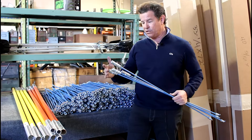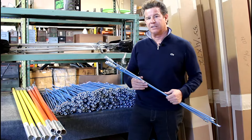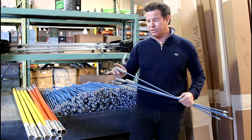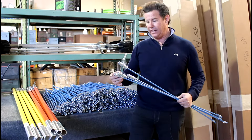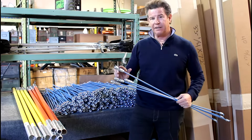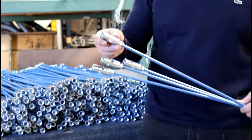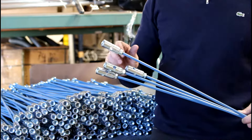All of our tools, of course, fit with adapter rods on the end of these rods. They come 50 to a box, and the couplings are all precision made — they have to be to connect together. They're plated, and after plating we bake the couplings to eliminate hydrogen embrittlement that might form in the coupling.